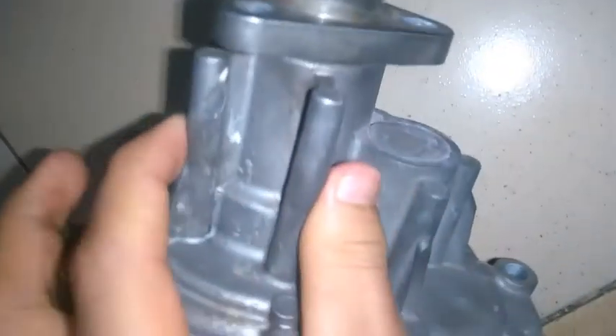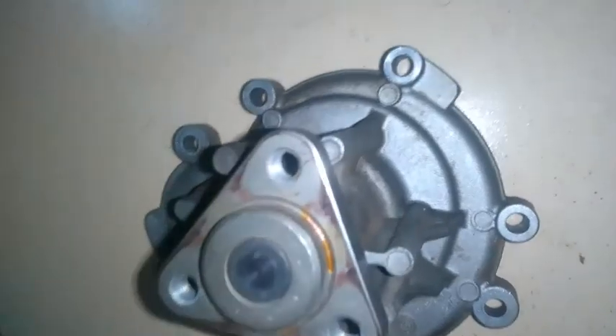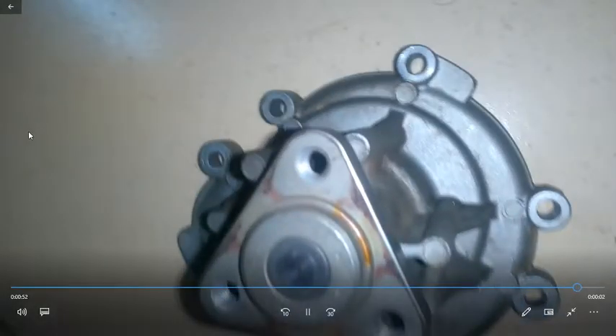Let me fix it properly first. Okay, this is fixed. Now let me try to rotate it — I do have a camera in one hand so it is a complicated situation, but let's try anyway. Here, while I am trying to rotate it, it is rotating easily. But what would happen if the spacer was not there? It may touch the outermost portion. You can see there are some ribs here which would not allow it to rotate properly if the spacer was not there.